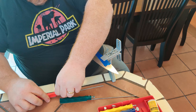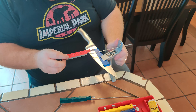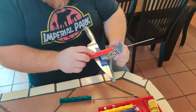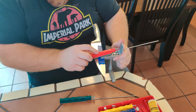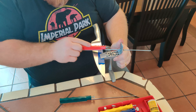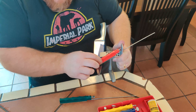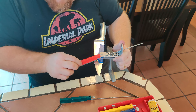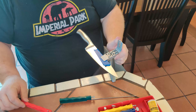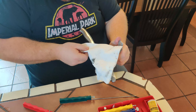In any event, I'm going to switch to a much coarser stone. This one says it's 120 grit, and that's just to kind of reprofile this edge. If you're listening carefully, you can hear that it sounds different because I'm taking pieces off of it. I'm pushing rather hard just to try and get it to shape. You can probably see the knife flexing — be careful out here on the edge because it does flex and that changes the angle at which you're grinding.